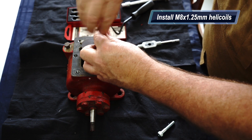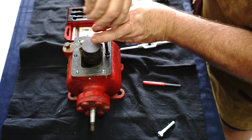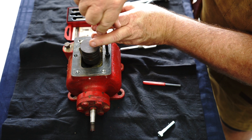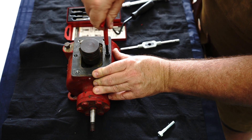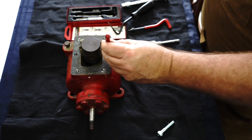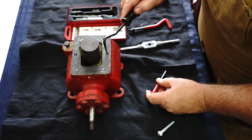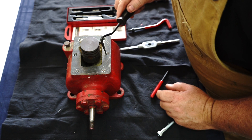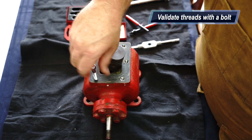This is the tool used to fit the helicoil. If you set it right it will go down to its depth stop and stop at its correct depth. There'll be a tail inside which you've got to break off. I've just stuck my little magnetic spike in there to pick up the tail and pull it out to retrieve it. I'll check those threads now to make sure they're okay and valid.